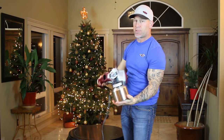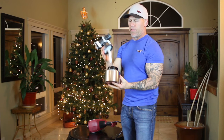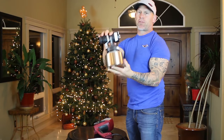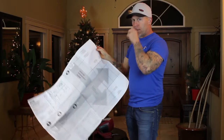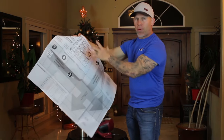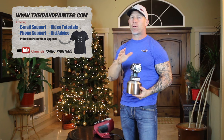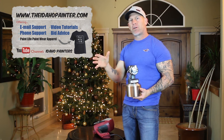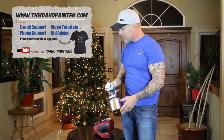I'm going to fill my unit with some water to show you the operation. The unit does come with a manual instruction and a practice poster that you can pin up to see your spray patterns and how they come out. You definitely want to practice with it and get your dials adjusted — the air-to-material flow just the way you want it — before you start spraying on your actual project. Use that poster or just a big blank piece of cardboard to test it out before you begin.